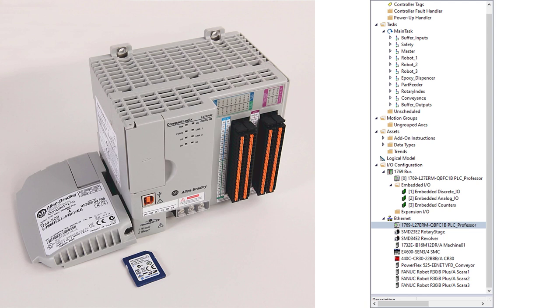Because the 5000 platform — ControlLogix, CompactLogix, etc. — has an asynchronous nature, meaning the I/O is updated asynchronous to the program scan. I said periodic task earlier — I meant continuous task. If you look next to main task, you see the clockwise swirly, meaning it is a continuous task. You can only have one continuous task in this platform. You could have two processors in the same chassis, each running something separate but working together to a common end, but in this case we have one continuous task.